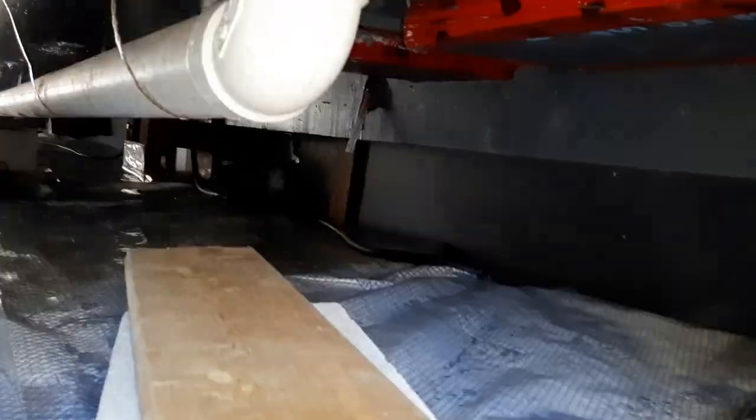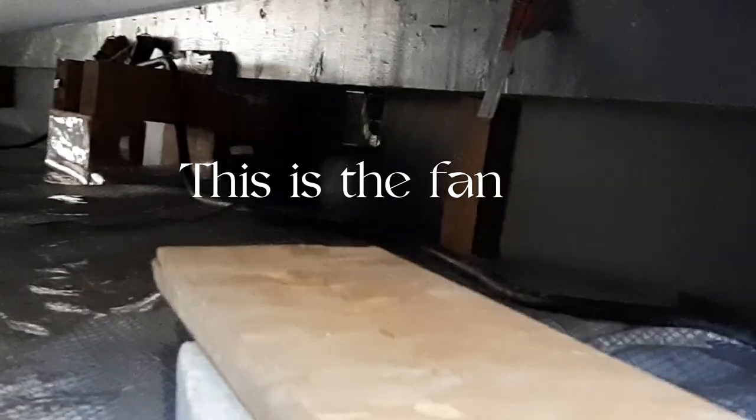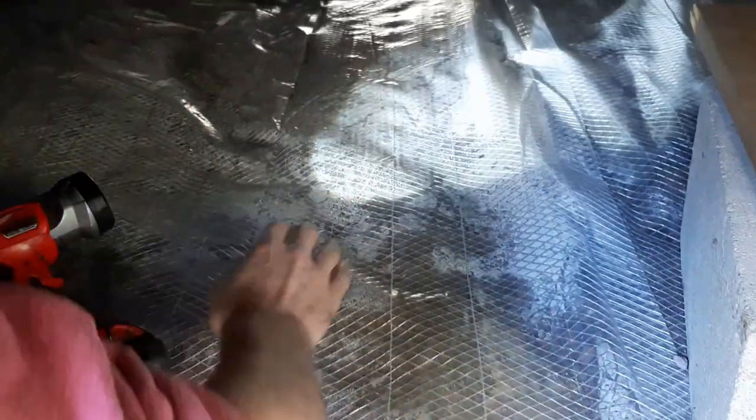Lastly, we laid down a plastic sheet on the ground — I'll put a link in the description for the material we used. We bought it in a big rolled-up sheet, measured underneath the house particularly where all the footings were, laid it out in my partner's basement to pre-cut it, and when we brought it back we just rolled it out in one shot. The day after we laid it down, we could see condensation and little water droplets coming up from the ground. So unless you have a concrete pad — in which case I don't think this would be an issue — I would still use the primer and paint that is mold and mildew resistant underneath.